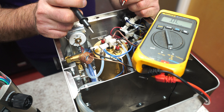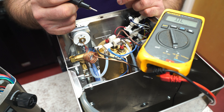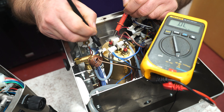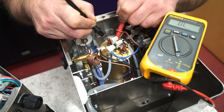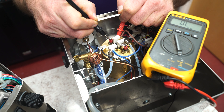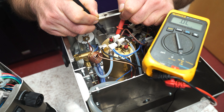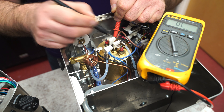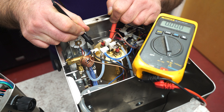The other way to check the heating element: if the heating element melted down and the filament is exposed — where the electricity goes through the filament to heat — and it's exposed to water, you could touch one side on the terminal. Again, wire's not connected. One side into the boiler wall or to the metal. If you get a beep, that means the heating element melted down. I typically ask customers to plug it into a GFI outlet which has a test/reset button — if the heating element melted down, it would trip the GFI. If you touch the boiler wall to boiler wall, you're going to get something since the machine is grounded, but you should have nothing from the terminals.